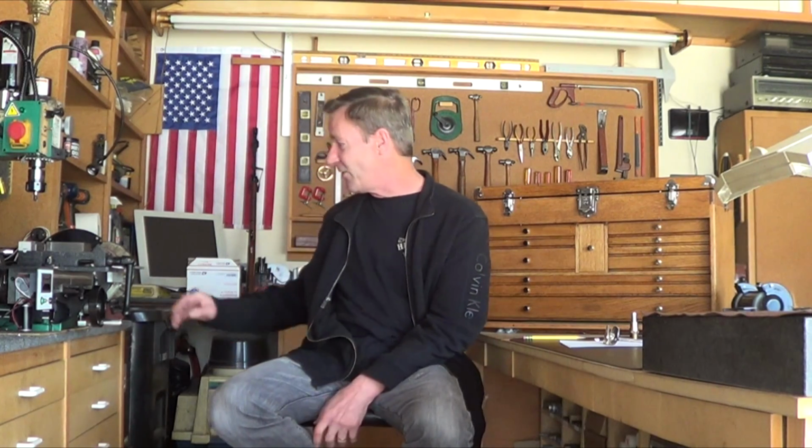So now it all turns easily by hand, and I don't know where the real funny noise went. It's gone. But now when I start it up, even after tightening the belt, I can hear it slipping. I gotta slowly bring it up to speed, otherwise I'll hear the teeth jump. So I can't do much on the lathe until I get that, but in pursuing the threading goal, I'll take you over here and show you this mini pallet that I made now.